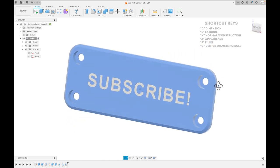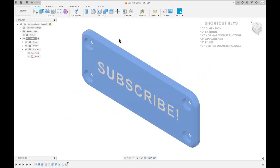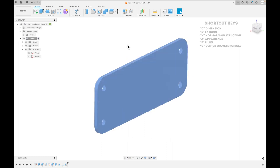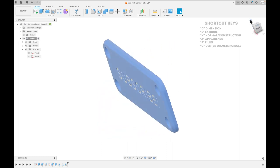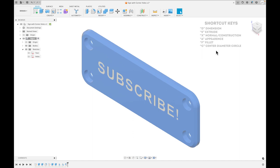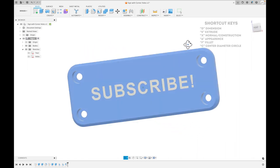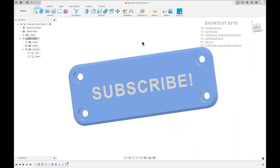Turn the origin off for a clean look. I'd still add the chamfer — 3mm looks good, maybe 2mm for this version. And there it is — that's how I make the same sign with four corner holes. There are also ways to make a hidden mount with a cleat design on the back; comment below if you're interested and I can do a quick video on that. This design has a lot of symmetry, it's pretty clean, and it's a short timeline.